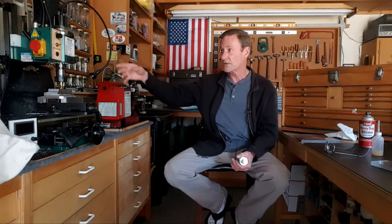It turns out, with playing around with it, the belt drive upgrade is on the lowest speed, the motor's smallest pulley to the spindle's biggest pulley, maximum speed on the pot, and you get just a gorgeous finish. So I'll show that. Sorry, you can hear some guys shoveling, more construction in the neighborhood.